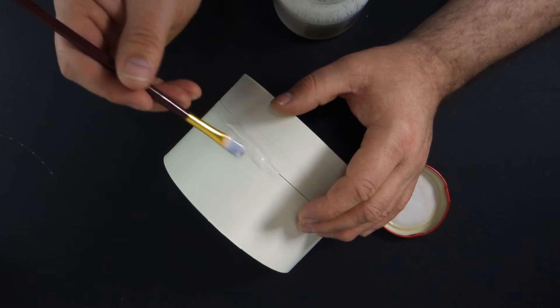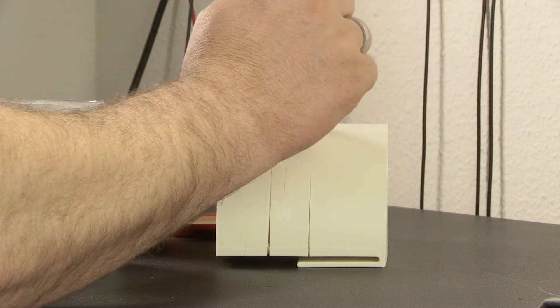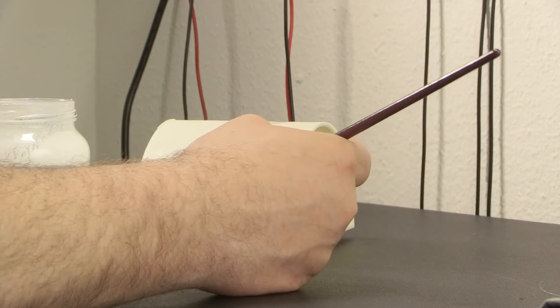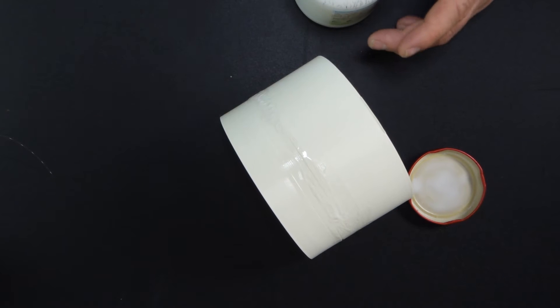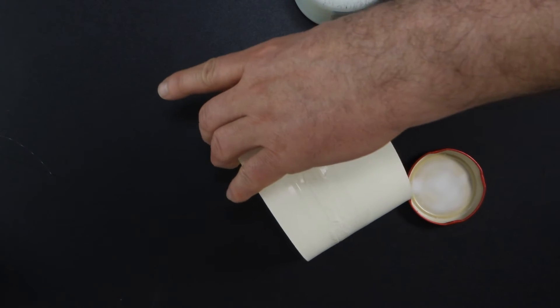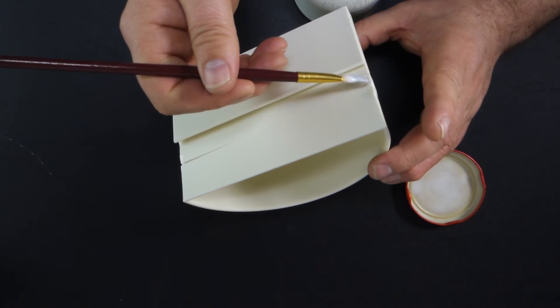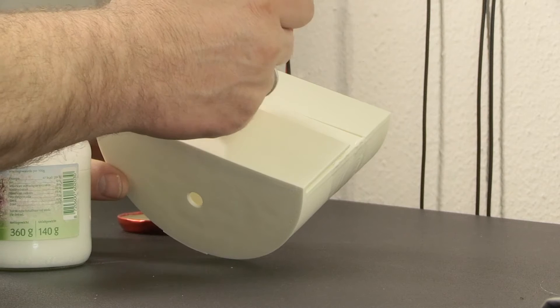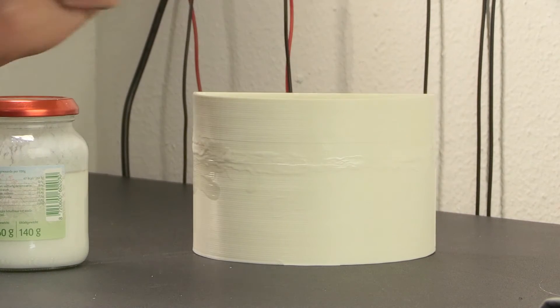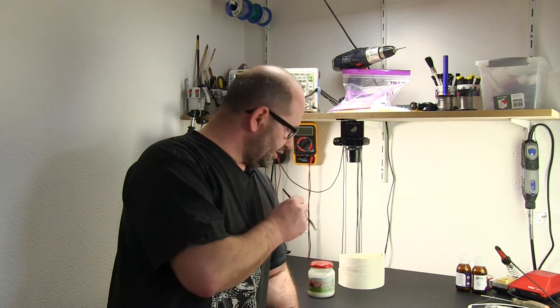At the end, all the acetone will vaporize and you'll be left with a nice clean print. You can see how quickly I repair this part, but it needs some time to vaporize — and that won't be a short time, so you have to be patient. The real strength will be there in about five or six hours, maybe a little more. I'll leave it to dry now, and after that I'll come back and make another layer, and another layer, and another. After a few times you'll see the print is perfect.